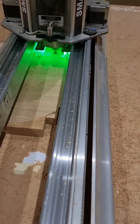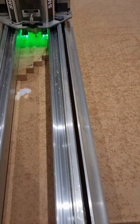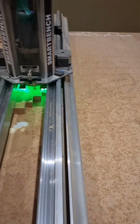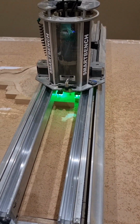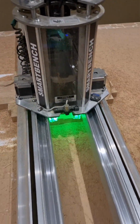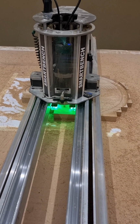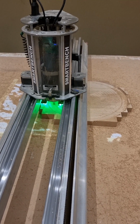Okay, so let's run a bull nose round, which will be filled with resin. Just give it some detail. Go through 2 passes. But again, just watch the rails, don't fill up with dust. Just keep an eye on it. If you get lots of dust in there, then it'll jam the wheels. I mean, they're doing all sorts of problems, but slow and steady, and you get there.